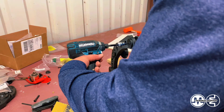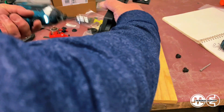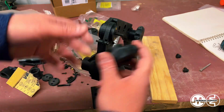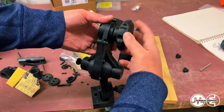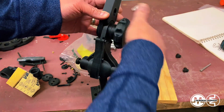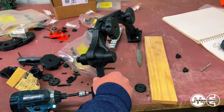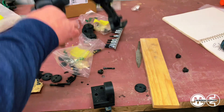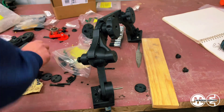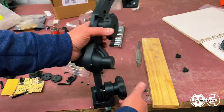It's time to take this thing apart and see how the new knobs help with the rigidity. Another thing I'm trying to do with this knob is have the faces match the diameter of the assembly, so I can create as much surface area pressure as possible. My hope is to create as much friction as possible through all this surface pressure. The larger diameter handles make it a lot easier to adjust and tighten quickly.